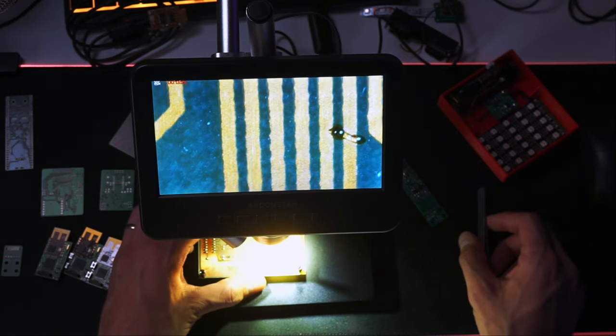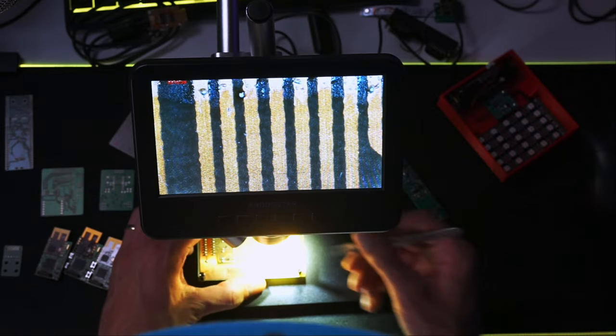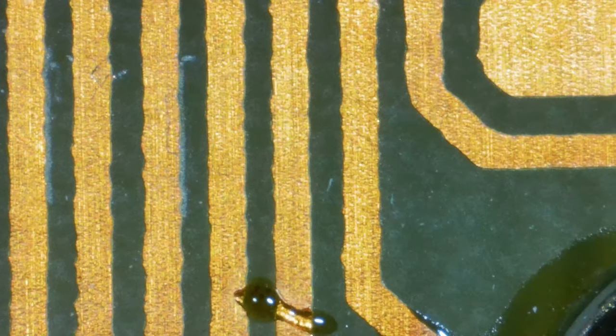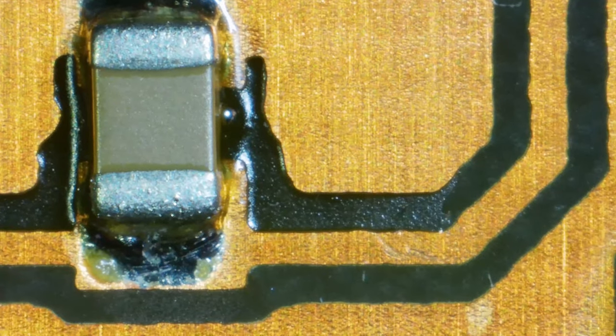This is a board I manufactured at home using a mask I printed on an inkjet printer on foil, then put on top of the UV-coated raw PCB and shone UV light onto it. The mask prevents destroying the coating where it's sitting, while the other parts are exposed to the UV light. You then develop this, which takes the photoresist completely off. When you put it into an acid bath, the acid attacks and removes the copper lines not protected by the photoresist. And as you can see, those lines should be straight — but they're actually curved and bent, and not very perfect.